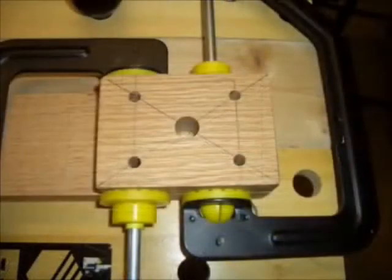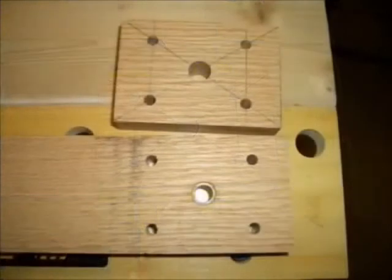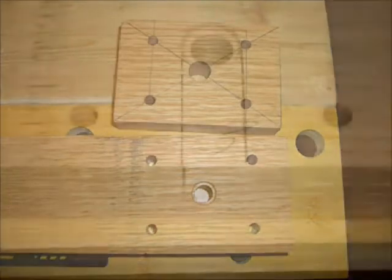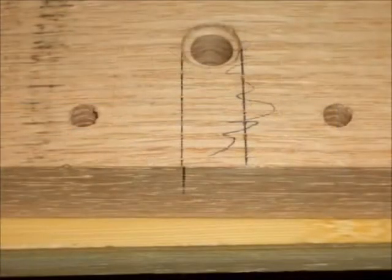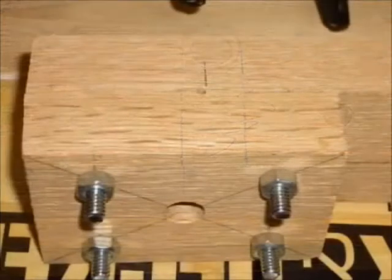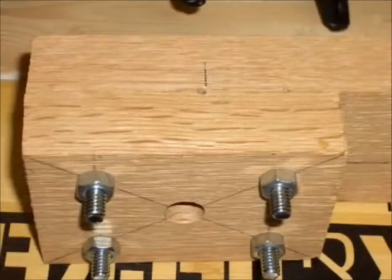The hole in the middle on the front side of the jig is a half-inch diameter hole. The hole on the back side of the jig is a 3/8-inch diameter hole. When these blocks are bolted together, a 3/8-inch diameter steel rod will pass through the larger holes in the middle. I then laid out and drilled about a 1/8-inch diameter hole that went along the face between the two boards and intersected the larger hole in the front of the board tangentially.